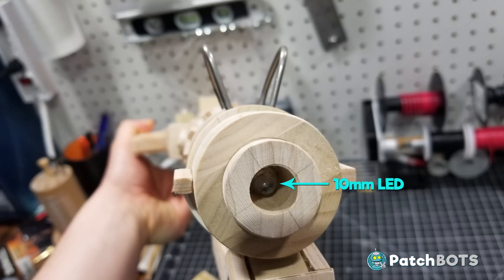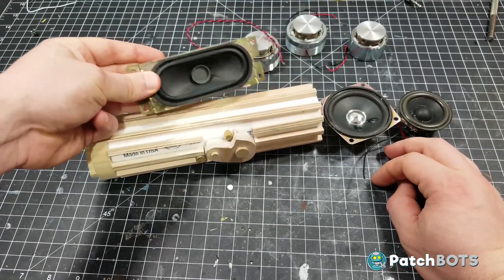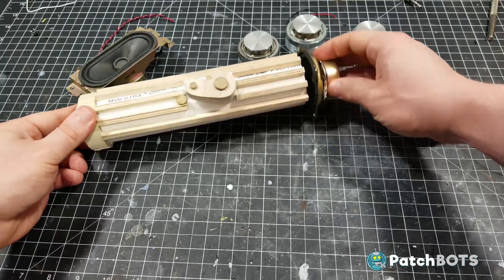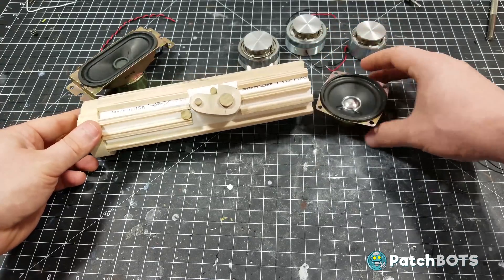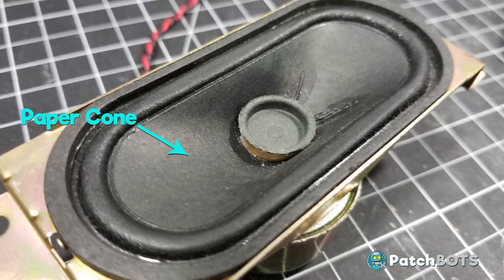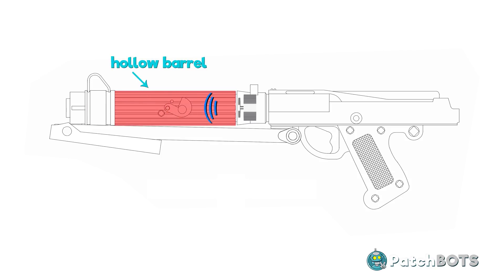The blaster comes standard with a 10 millimeter blue LED at the end of the barrel activated by the trigger, which is perfect. I also want to add in an audio circuit with some cool blaster sounds. The problem is making it loud enough — generally speaking the only speakers loud enough are too big to fit inside the gun. Luckily there is an alternative: transducers. Transducers are speakers that can generate serious vibration, and rather than vibrating a paper cone like in most speakers, they vibrate whatever you attach them to. So for this gun I'm going to make a housing right in here to hold the transducer and have it vibrate the entire hollow barrel, making cool sounds and even some vibration feedback for the shooter with every blast.